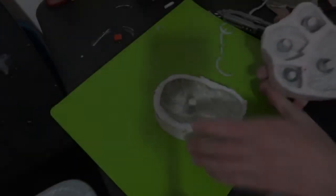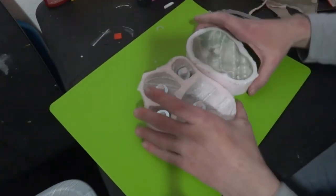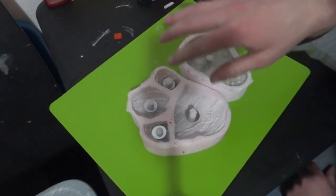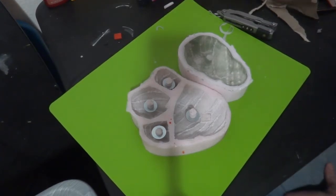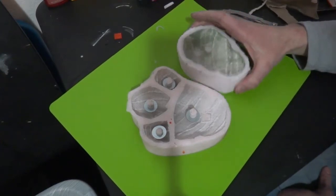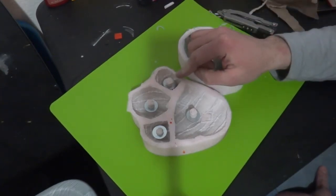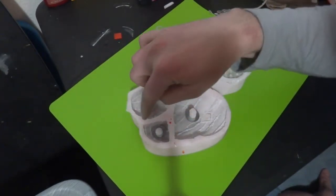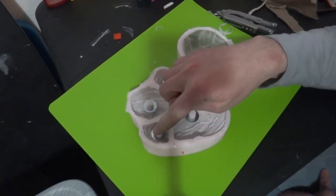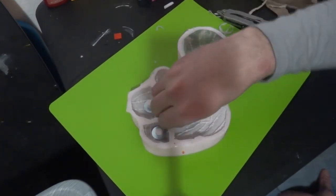I encourage you doing multiple molds at once because it's a lot more efficient. So when you're looking at it, this is just a little over a pound of silicone, not much more than a pound. Pretty small amount of silicone still. With this mold, we spent all that silicone on just one. Whereas on this one, I've shared that border wall here with three other holds. So instead of having to cast two extra walls for just that one hold, I've only had to cast just that one edge for this hold. And it's sharing this with this one. All four of these holds are splitting the cost of this. It's a lot more efficient.